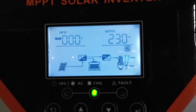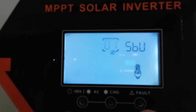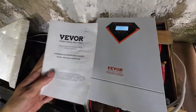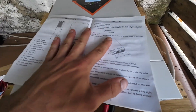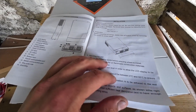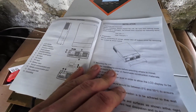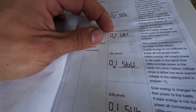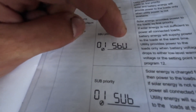If you want to get into the menu to configure it, all you have to do is hold the enter key. Then you get into the menu. The manual is actually very good. And I'm not just advocating this product because VIVOR sent it to us — we have a long-lasting relationship with VIVOR and I had already been using their products for many years. So these modes here are solar first, utility first, and then solar battery utility. That's probably the one you want.